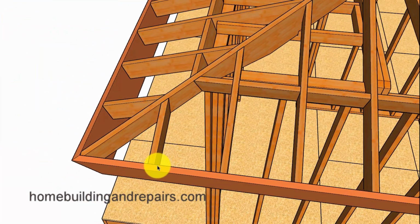And on our hip roof we are going to have a couple of rafters here. You're thinking like, wait a minute, what are these guys doing here? And these are basically just providing you with a little more support for the roof sheathing and to continue with our 16-inch on center layout. And of course we will need to cut some funky blocks here in the corner.